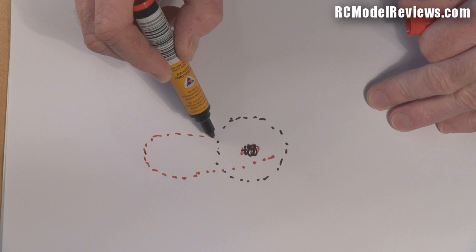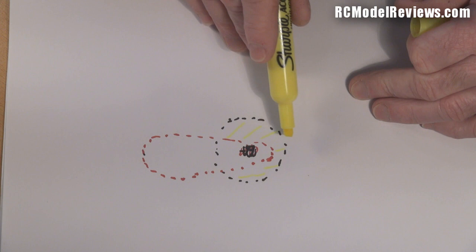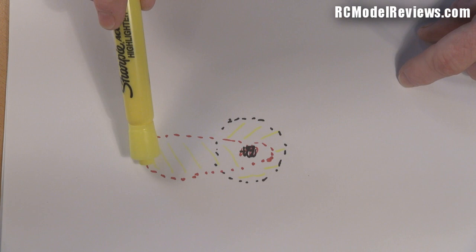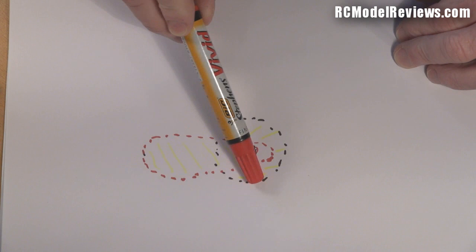On the diagram you can see areas where the omnidirectional antenna has a stronger signal, and areas where the helical has a stronger signal. The diversity controller switches back and forth between the helical and the omnidirectional. The limitation is that as you get further out, you can't fly too far to either side before you exit the beam of sensitivity, leaving you with a relatively narrow corridor in which you can fly.